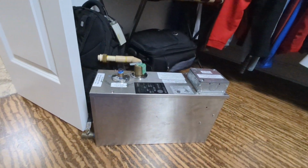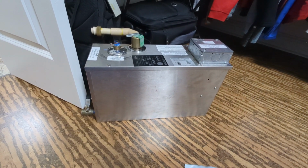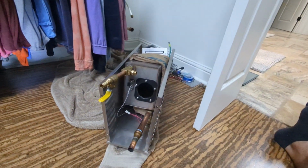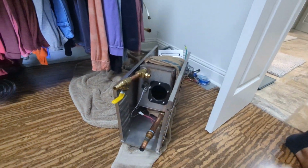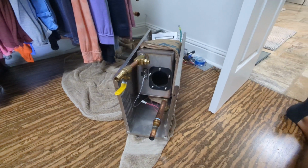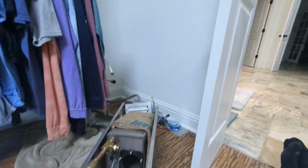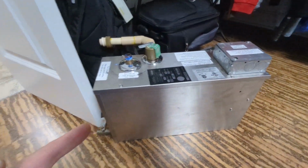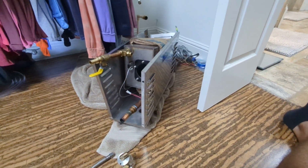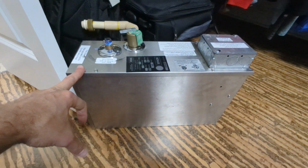If you've got a 1733 series Kohler, 9 kilowatt, but they went, I think, 4, 5, 7, 9, 11, and they did the same thing here. This is made by Thermosol somewhere in Texas, and this is made by Kohler somewhere in Wisconsin. I think their Kohler factory in Wisconsin. Same thing, both sides, and the keypad actually will work for either. So if you have an old 1733 and you can find a 5529, you can simply take it out and plug it back in.